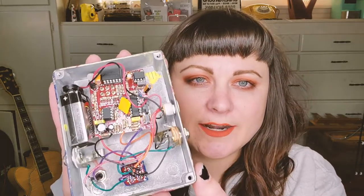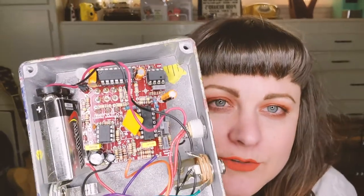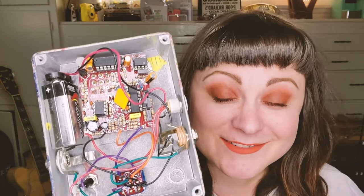So this is another thing where I want to go through. First, look at my wire connections, tidy that up, make sure all the joints, the solder is really clean in those lugs, etc. And then I really want to go through the circuit board and make sure everything is positioned properly. You can tell just looking at it, I looked at these capacitors, for instance. They have polarity and I double checked they're all in correctly. But if you see an obvious problem, please feel free to tell me. I would love to fix this. I have no shame. If I'm doing something wrong, please tell me. Yeah, this is another one I'm going to have to just break out the multimeter for. It's a shame I never even got this to have any sound when it was activated. So hopefully I'll get this up and running.